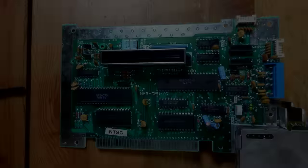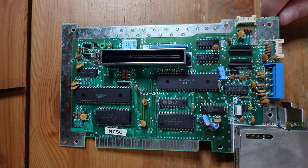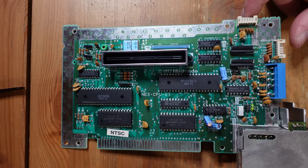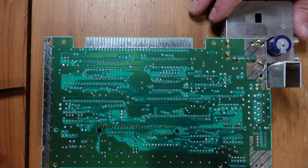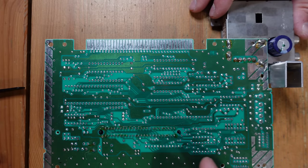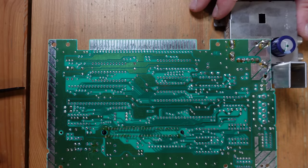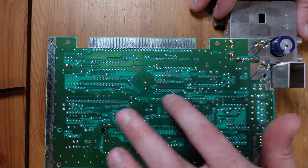With this mod you start right away with the most difficult thing: removing the PPU, or picture processing unit — the main graphics chip on the NES. This is a 40-pin dual inline package, or DIP chip, and removing these is tricky. My three-step approach: first, add fresh solder to all the points to help everything flow more easily. Then come in with a Hakko desoldering gun to desolder all of those points, which gets rid of most of the solder.